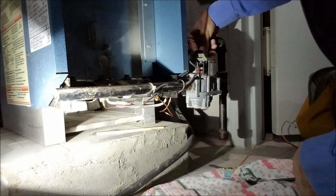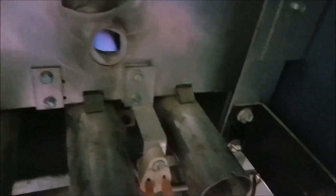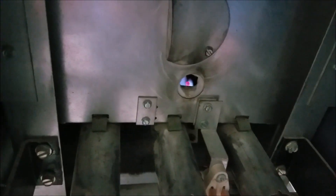I hope this is the sensor problem; otherwise, I have to change the gas valve. See the pilot light — all right. And the sensor looks like it's cooked — cooked at the tip. Got too much fire. Wow, it stays on! So the pilot light sensor was the problem. Right now it's on. Now I've got to adjust the tip — see, the tip is cooked. See the red color tip.